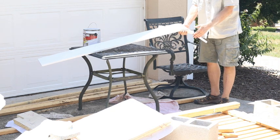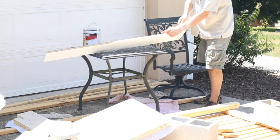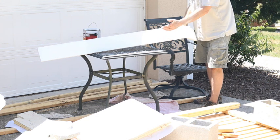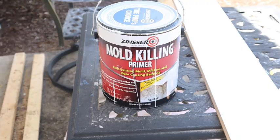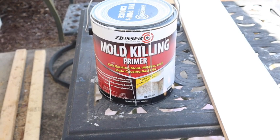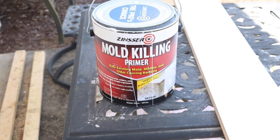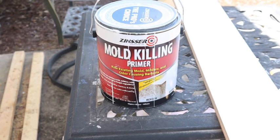This paint came out excellent. Sanding down and using the wood filler, you cannot even identify on the outside where the seam is, where I used dowels and put those two together. Then, once again, I sanded down to 220 grit paper, and after that, I let everything sit and dry for another hour. Make sure everything's nice and hard and cured. This is a multi-day process.